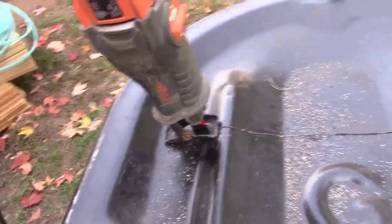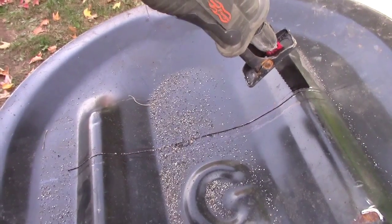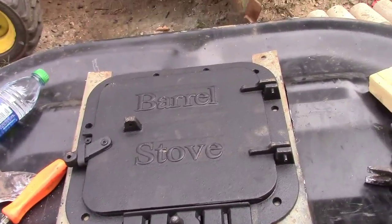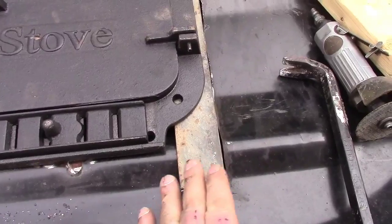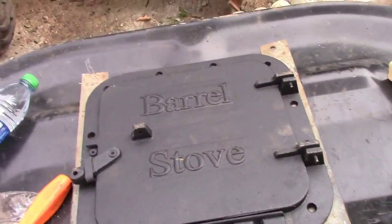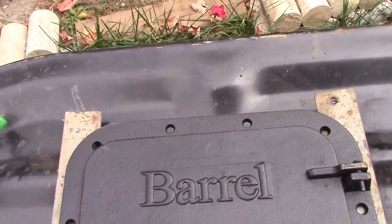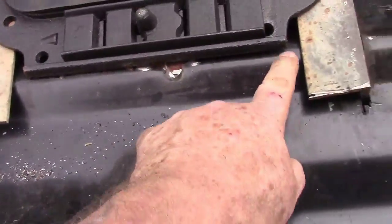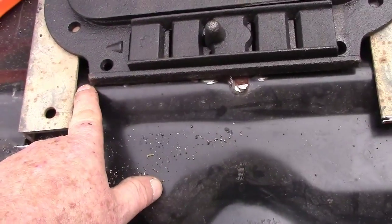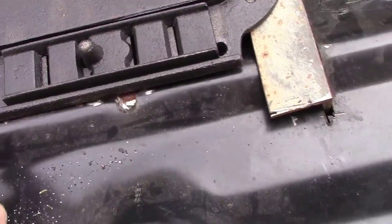The camera seemed to have followed me. I've got to do one more weld right there, but I won't bother you guys with that. So that's where we're at so far. I just need to straighten that up a little bit — it's got a slight cant to it, so I just have to bend it up a little bit. Then I'll get a measurement on the cross, get a crossbar in, and take care of the top and bottom parts. I'll just take a piece of flat stock and slide it in here.